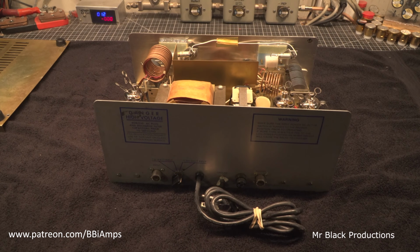Now on the bottom side of this, I'll show you there's 2 different coax connectors hooked up to the output. Now in the 300A, when you would hit the high and low switch on the front, all that would do is kick out your driver tubes. So then you're just running right on your finals. And that's where they nerfed it: they had a variable air capacitor, a little Arco capacitor on the input of the 4-tube section, the final section, and they had that muted way down. So everybody and their brother drilled a little hole on the bottom of the cabinet. We'll say this is the bottom of the Palomar 300A. There'd be a hole like right here. You take a screwdriver and get up there and adjust that.